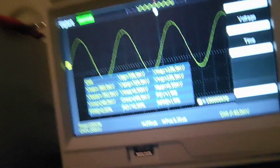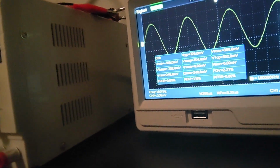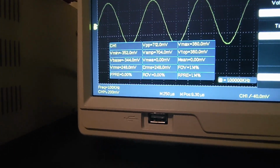At 1K hertz, when I go clockwise, at no point in time did the amplitude increase. It didn't get larger. So as I was going off frequency, the gain I was given per that frequency was no longer being applied because I was changing the frequency. I was going from 1K up to 2000 hertz. So it makes sense that as I move closer to 2000 hertz, the less gain I would see on my oscilloscope, because I was no longer on frequency. Now the same thing should occur as I go counterclockwise.